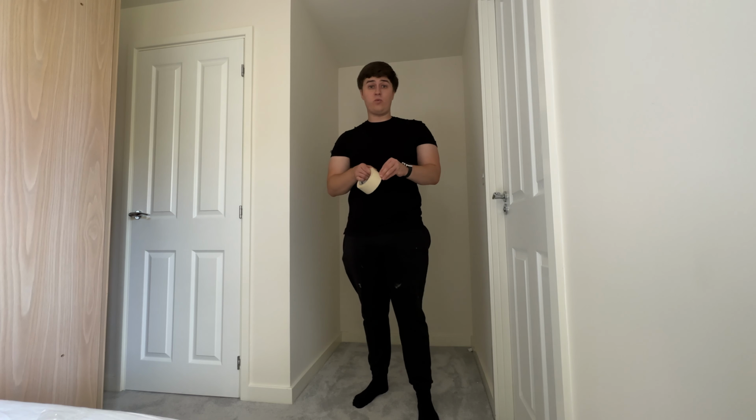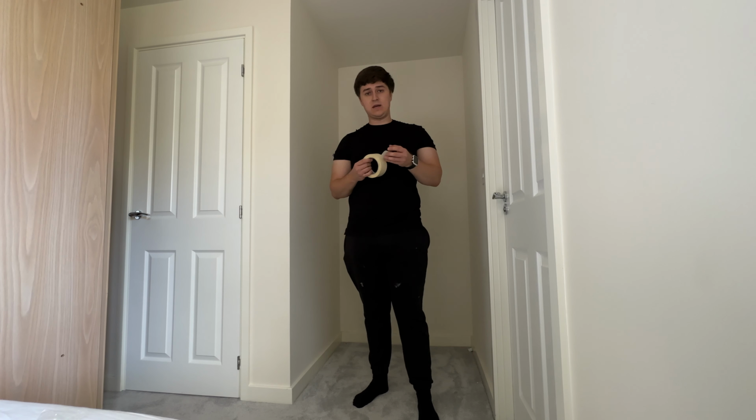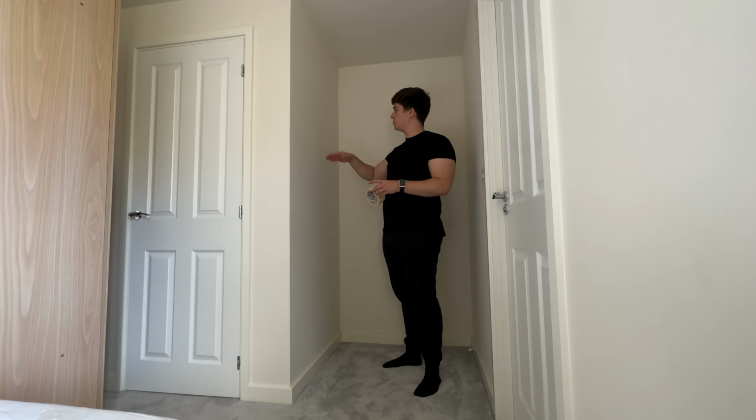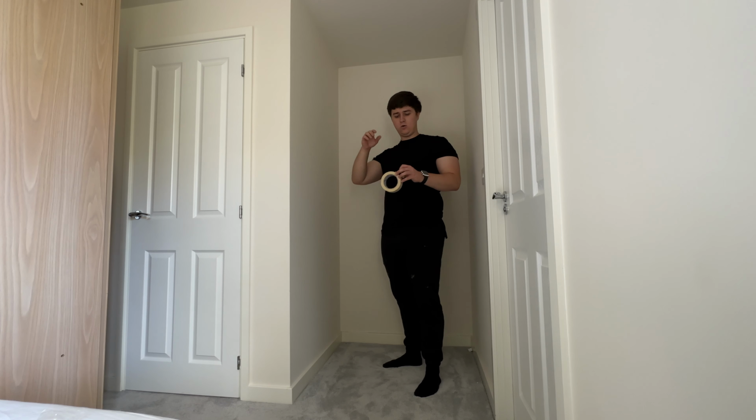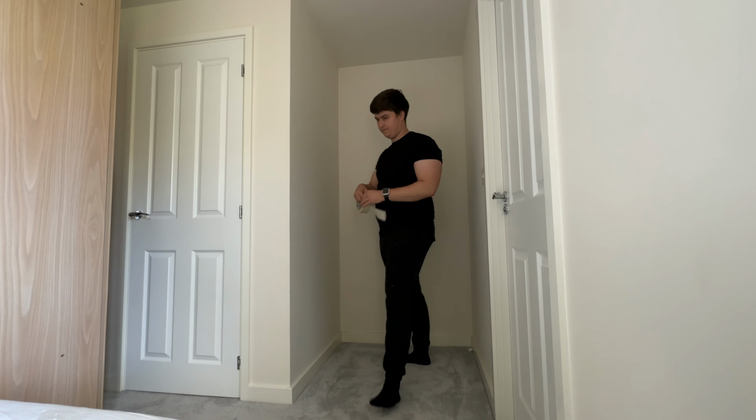Another good tip for when you're drilling, especially plasterboard or drywall, is to use a bit of masking tape and attach it to the wall just under where you're drilling, so that all the drillings get stuck to this and it's easy to clean away.